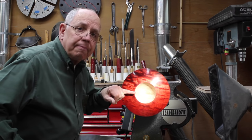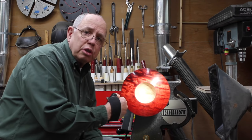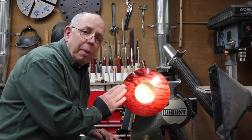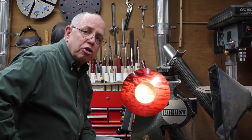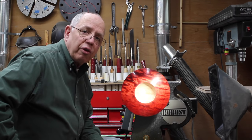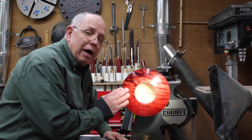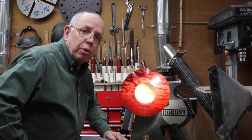On the sanding — when you're sanding this back, you want to get rid of any gloss that might be on there, because that gloss means it's a low spot. You want a nice flat finish. After you sand it, wipe the dust off — that's when you can really see if there are any glossy spots left. If there are, go back and try to sand those out, so you don't have those glossy spots. Because if you finish it and you have irregularities in your surface, they're going to stand out like a sore thumb as soon as that light hits it. That's why I put so many coats on — so if I do have that, I don't have to worry about going down into the finish or sanding through the stain, because then you'd basically have to sand it all off and start over.